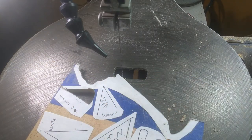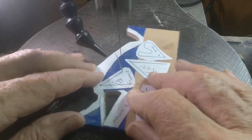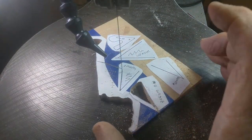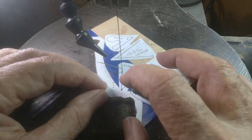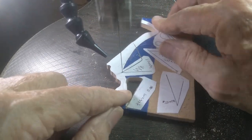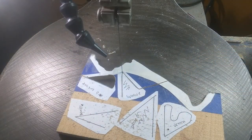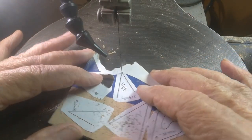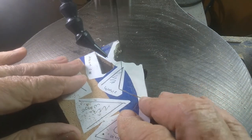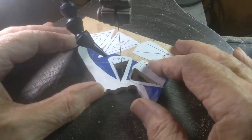Now you've got one where the waste is on the inside, so we're going to cut in from here. If you didn't have waste at all, you can do what I did on the 90-degree angle — you just have to be very careful with it. In that case you just take your time, put the pressure against the back of the blade slightly as you turn, and allow the blade to cut its way around. It doesn't always give as clean a cut, so I come back and just clean it out, using the blade almost like a piece of sandpaper.